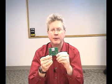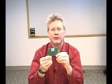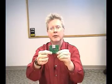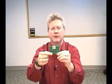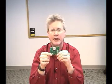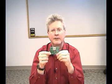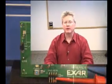Even though we've just output over 4 amps of current, the battery's only seen a 600 milliamp load. Now, let's press it again and hold it down, and you'll see the flash turns off automatically. There's a 110 millisecond timeout in this case, which turns off the output to protect the battery and also protect the device from overheating. Now, let me show you the torch mode.